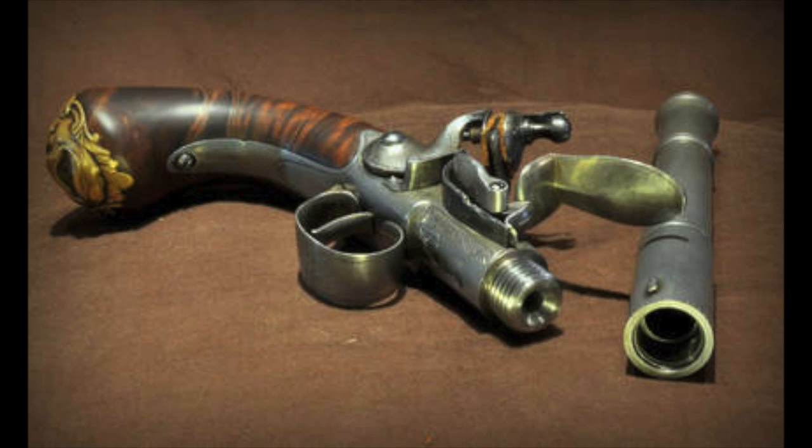Here's what it looks like with the barrel off. The powder and ball were loaded right into the receiver portion. You can see that cupped end — that is what the ball rested on, and the powder was put in that little hole. Then the barrel was screwed back on, and when it was fired, the ball was forced into the barrel through a tapered forcing cone, so it was a good tight fit.